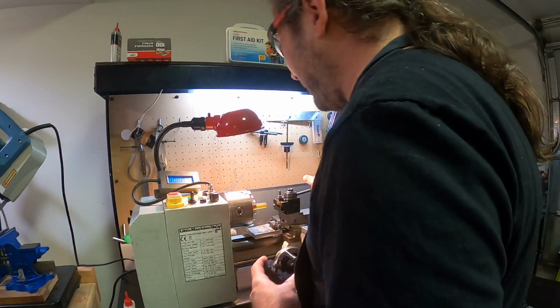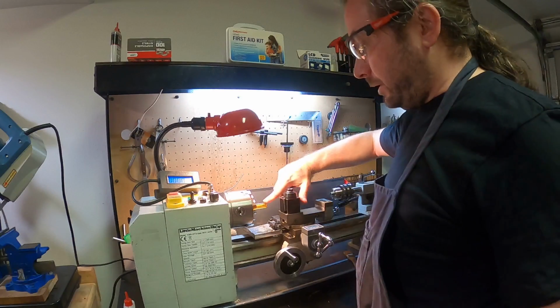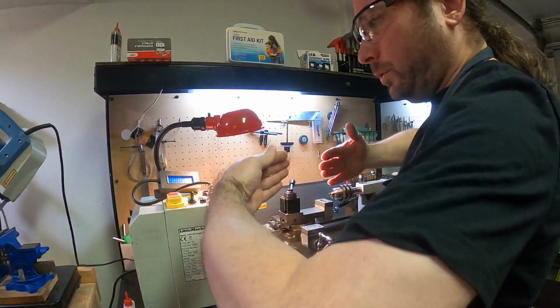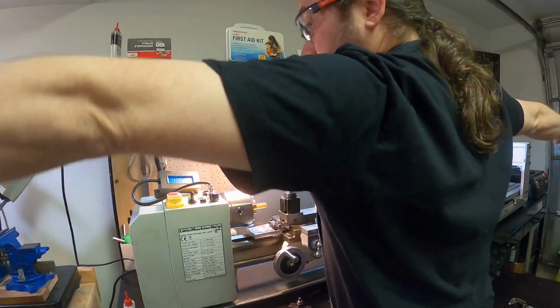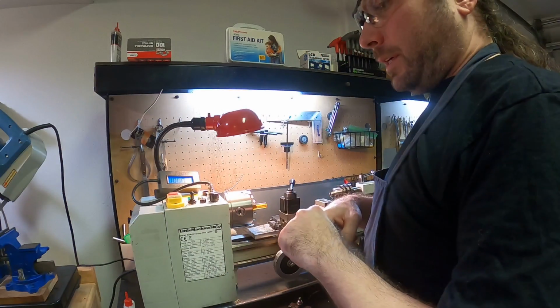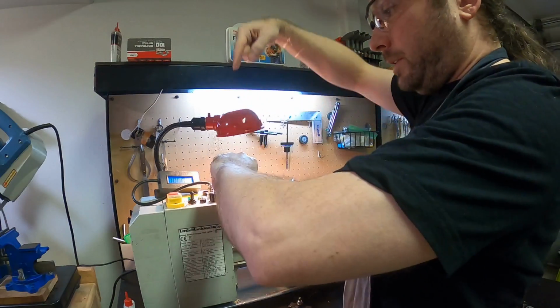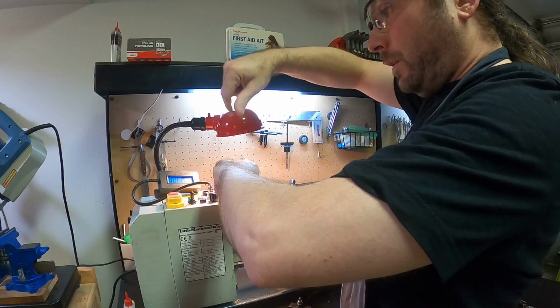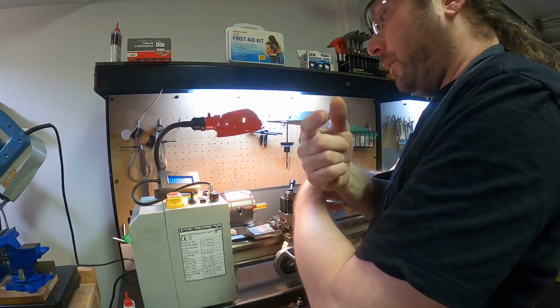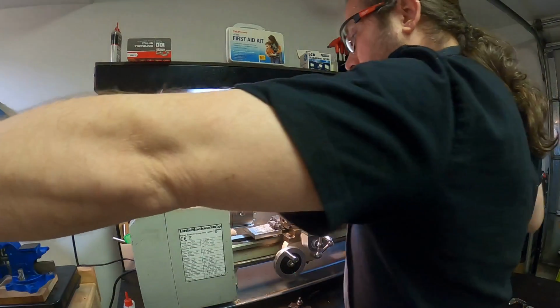So now we've got our hole, right? That's what the armature has, these two arms that stick out. One of them is tapped, and that's what the cutting stylus goes into, and it's tapped two ways. It's tapped this way, the stylus goes in, and it's tapped another way so the locking screw can lock it into place. And then the other arm is just all steel.